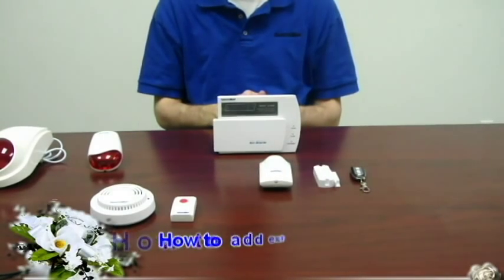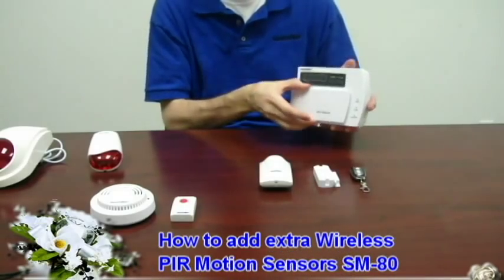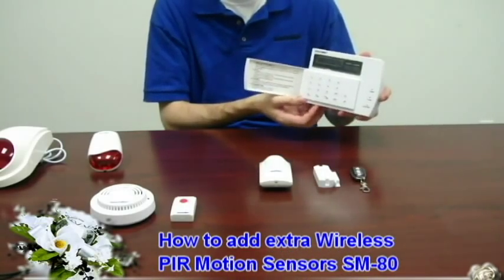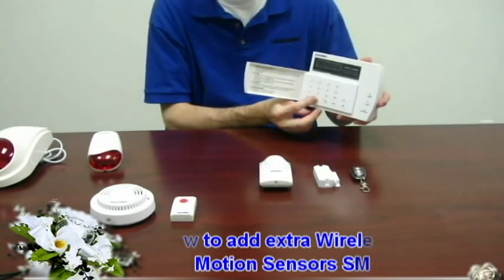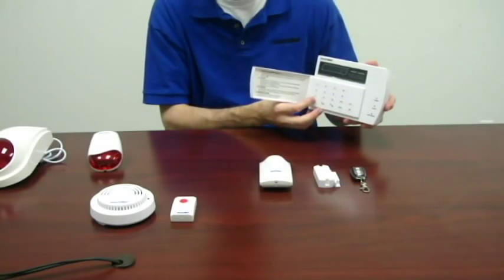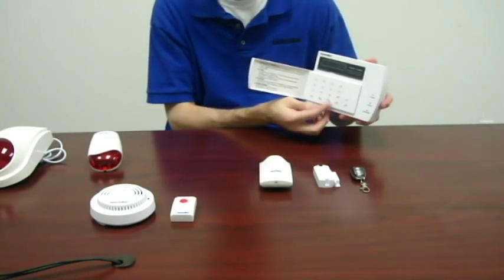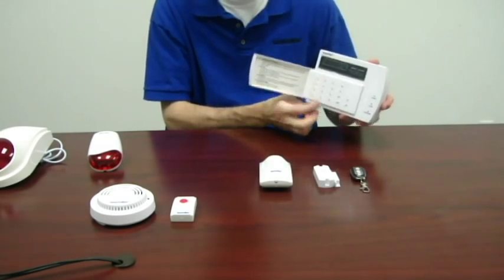To add additional motion sensors to your Air-Alarm1 system is quite simple. Please be certain that your Air-Alarm1 host keypad is disarmed. Then access the settings with Set, your password, 3 digits, and Enter. The code to add a sensor is 70, Enter. Please use zones 11 through 15 for your motion sensor. We can begin with 11, Enter.